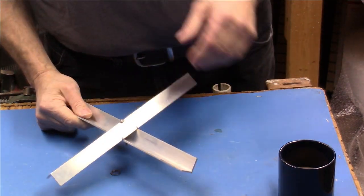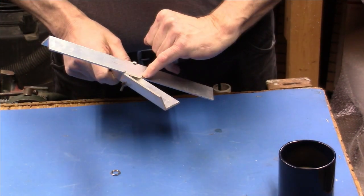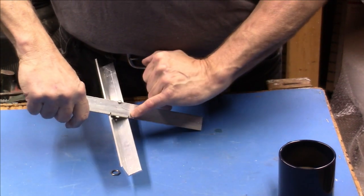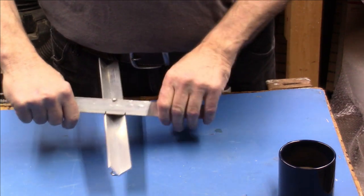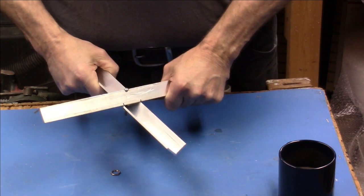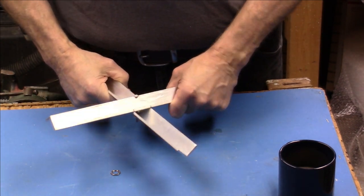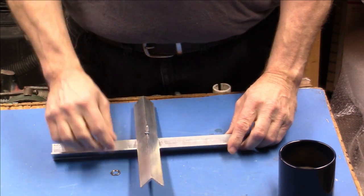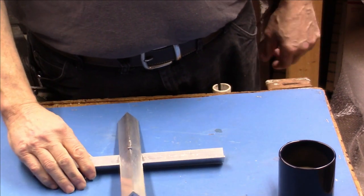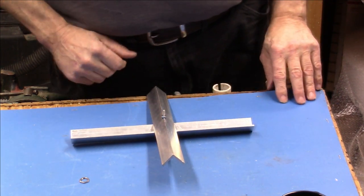Okay, this is really hard doing this backwards. So then what you can do is put a small groove here, a small groove here, a small groove here and here with the hacksaw, and this thing will lock together. This is only finger tight now, and it's locked together. So once you tighten this up with a wrench, you're in fat city. It's not gonna move at all. So I'm just gonna leave that there. And let me grab a couple of the pipes, and let me zoom out just a little bit here. Hold on.